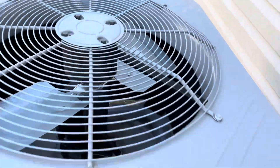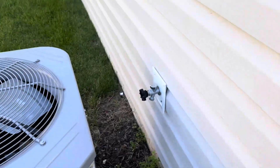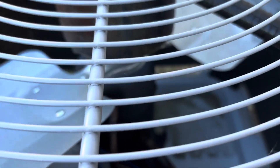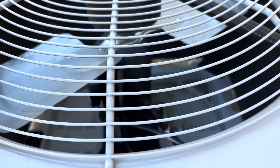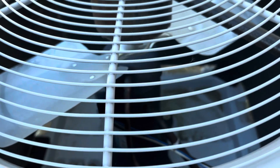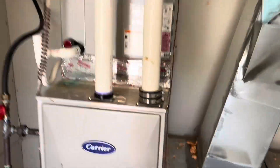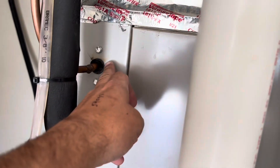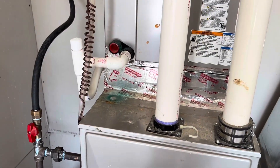Alright, here is the outdoor unit — straight air conditioner. Looks like we got no vent caps. Very low unit — couldn't ask for a better changeout for a compressor. Filter dryer. Let's go look at the area. Look at this garage upflow. We'll get that popped off — TXV will be right in here. Not bad at all guys, let's get this thing recovered and let's do it.